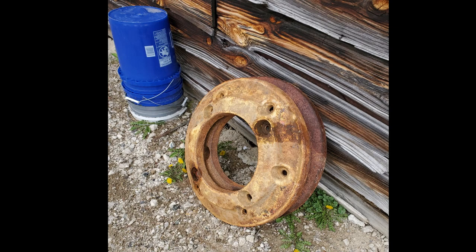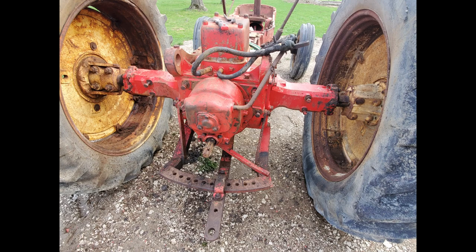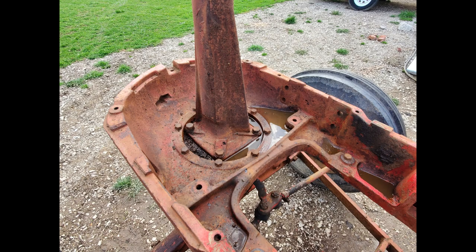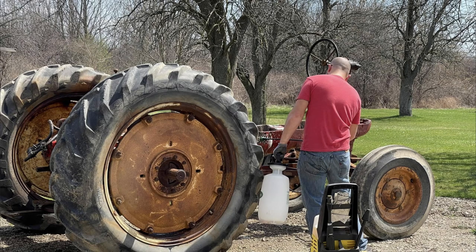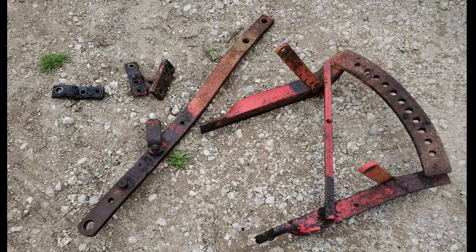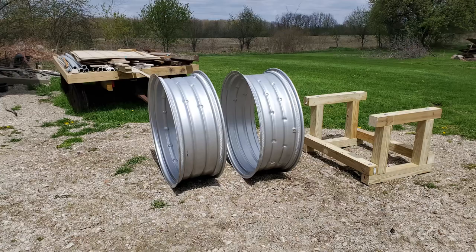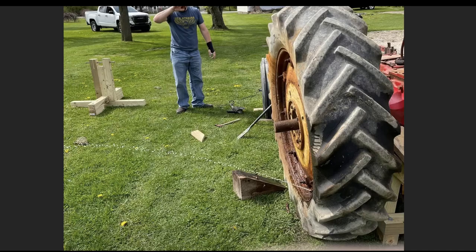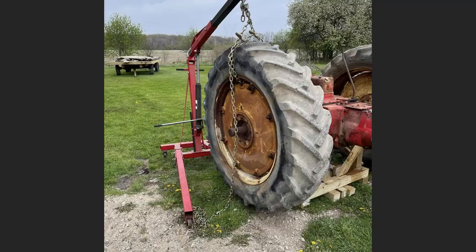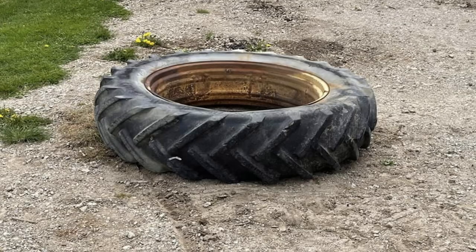The next spring I started work on the rolling stock. New tires were essential and the rear rims were shot, so these needed to be replaced. This meant I needed to get the chassis securely supported to safely break down these heavy parts. The rear wheel weights were removed and I degreased and power-washed as much of the old dirt and filth from the exterior. The hitch and draw bar came off and I made up some cribbing out of 4x4 lumber to solidly support the frame, and I picked up some new steel rims from a local tractor dealer. The left rear wheel was loaded with calcium chloride and was so rotten I only needed to smash it with a claw hammer to release the stinky funk within. Fun fact: calcium chloride is an excellent grass and weed killer — two years later and the grass is still dead.